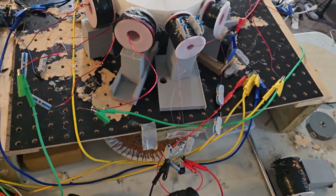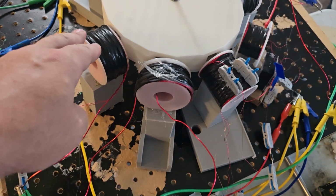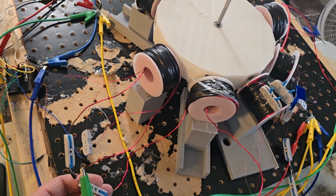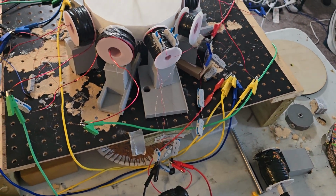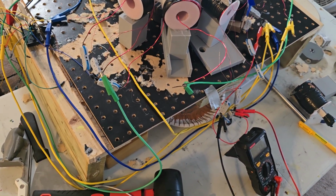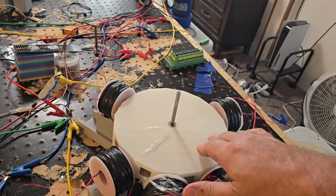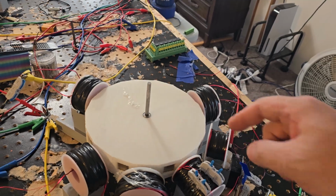We currently have this coil with only a series pickup coil, the same size as it. I mean, the coil is beefier than that, but I'm only hooking up the 16 gauge with the diode, so it's direct current. Each one of these 120-degree coils has its own transistor, has its own circuit, but it's all linked together through this trigger coil.